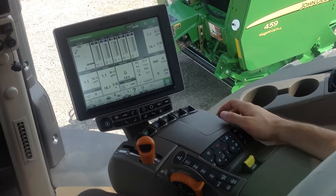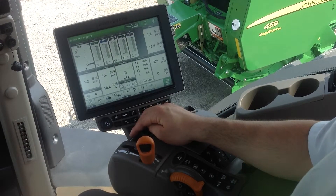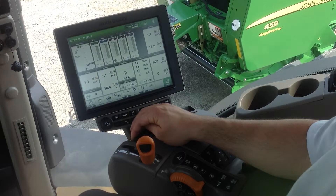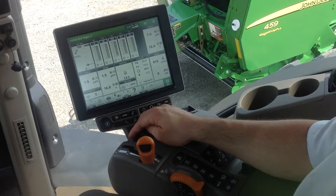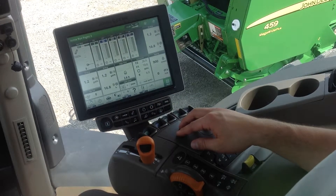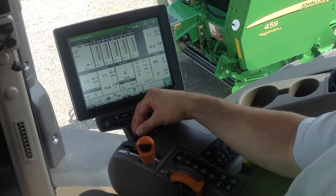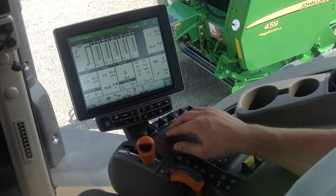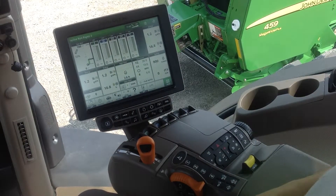The way I can utilize the set point when moving from transport mode to field mode — in the transport position, I'm going to have to raise the hitch all the way up. When I return to field position and get to the next field, I can simply take the control lever for the 3-point hitch, push it until it clicks, and it's going to automatically go to the set point each and every time. That helps take the guesswork out of getting the hitch back into the exact right position and makes it much easier.